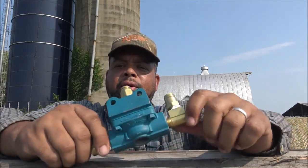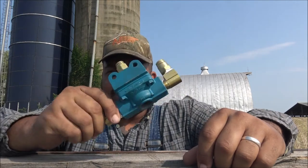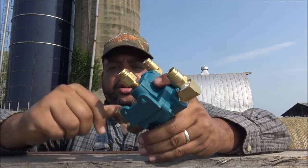So I loosened one of the lines on the old valve, and I can hear air coming out there, but no air down at the bags or the height control valve. So that tells me that the valve itself is bad. I was going to replace that valve a couple months ago, or might have been a year ago now, but everything was working fine, so I didn't. So luckily I'd already had a new valve on hand. I just needed all the new fittings.